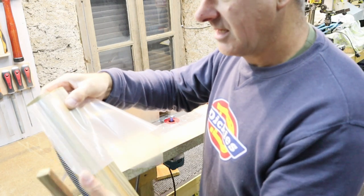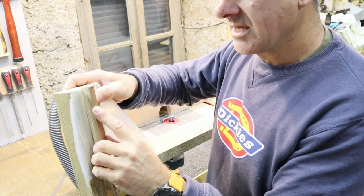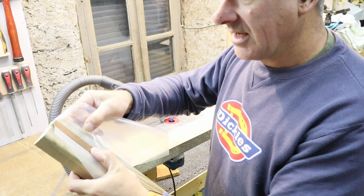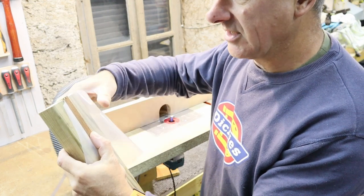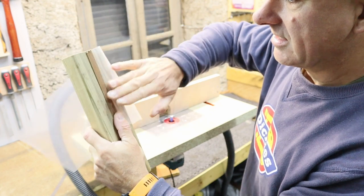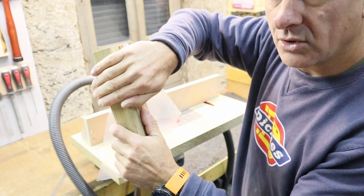the plastic. So I'm going to wrap the plastic across the frame and then insert this key, which is 1mm thinner than the actual groove, and that will hold it. A couple of pin nails, tack tack, and that is solid. And then trim off the excess, so that will be what I have. So it should be quite a nice finish. It will prevent lots of staples everywhere. It will prevent this being wrapped all the way around.